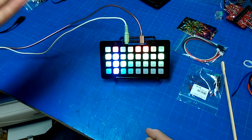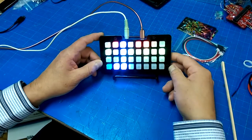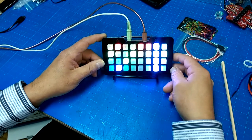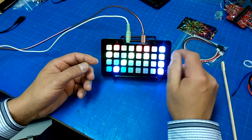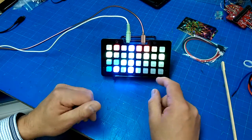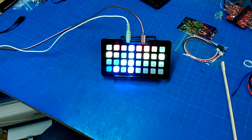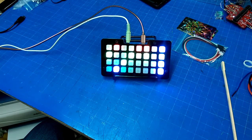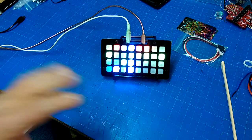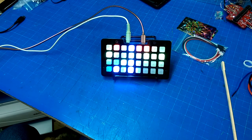So we've got a drum synth sequencer. This can be programmed in two different ways. You can either use CircuitPython, or you can use the SAMD mode of flashing. You mount this as a drive, copy files to it, and then it will reboot once the new UF2 file is installed on it. And that's how you reprogram it. Right now, I think it's running in CircuitPython mode, and so you can download new CircuitPython sketches to it, or you can actually put in a new UF2 sketch on it, and it will rebuild it as a UF2 device. So let's go load up some different sketches on it.